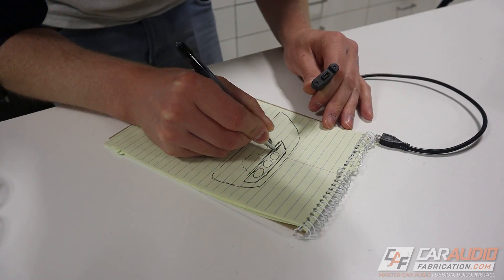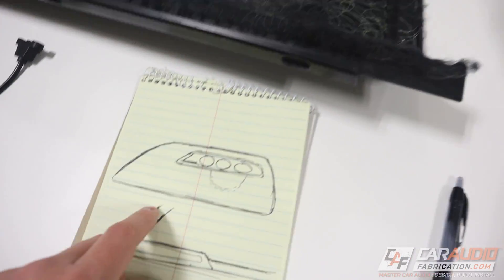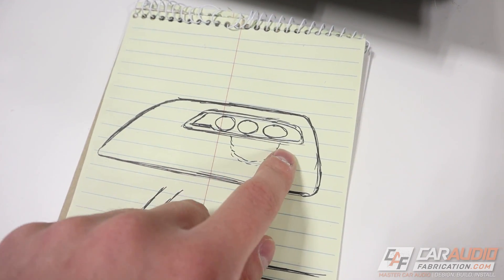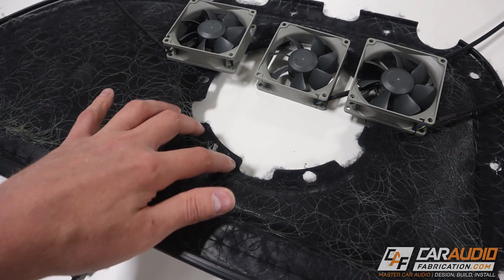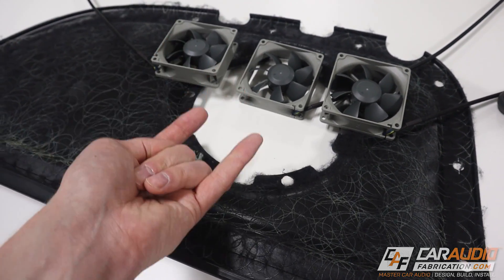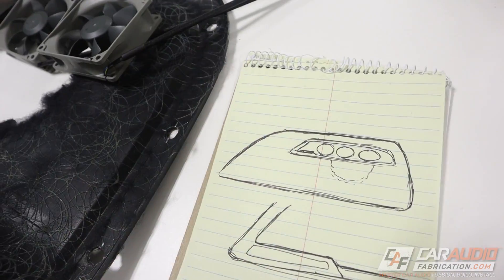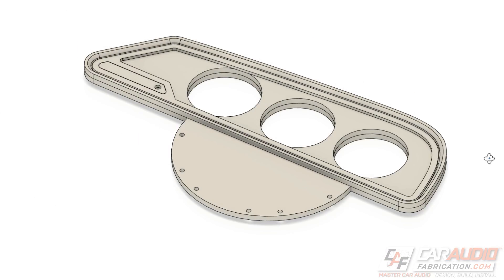I did sketch a bit of a design. I know that I want my insert to kind of match the overall shape, with this line being parallel to that curve. I know we're going to have holes for three fans, I want to use a portion of the plastic to fill the rest of this subwoofer hole as part of a mounting platform, I'll drill some holes and have screws come in from the back side tapped into that plastic, and I also want a little access cover for the USB port. So this is my rough sketch — let's come up with a more firm engineered design.